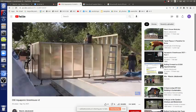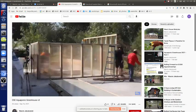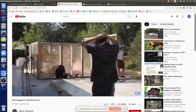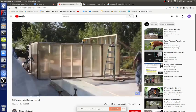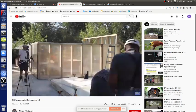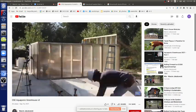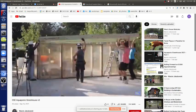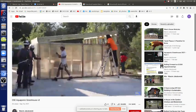You've got all the weight of the water at the bottom. After that we reinforced the corners because those screws can pull out — if you're going into end grain that's a very weak connection. You typically want to be going cross-grain in wood. End-grain screws pull out much easier, so on the edges we put two-by-sixes in the corners to reinforce. With these three-inch screws, pay attention to whether you're poking through the entire three inches — do them at a slight angle so you don't puncture your polyethylene water barrier.